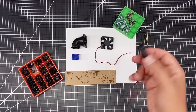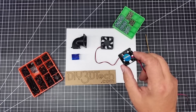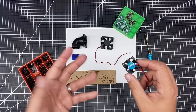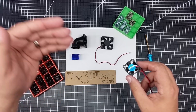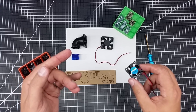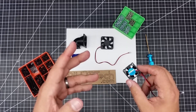The stock piece comes with this tiny — I don't know if this is a 25 or 30 millimeter fan. Anyway, this is meant to cool the cold block — they have a cold block between your hot end and where the filament feeds in. The idea is you want a sharp transition temperature between a solid state and a liquid state, and that's part of what this provides — it keeps that area cool.